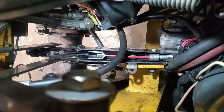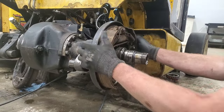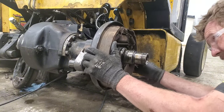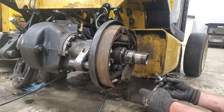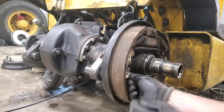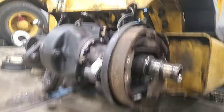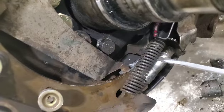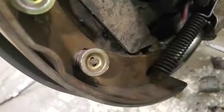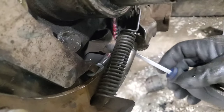Right here I lost all my audio — my mic gave out — but basically I installed new brake cables and ran those down to where the backing plates were going to be. They were damaged from earlier when the frame bent; something got up there and caught and pulled those brake cables out. So as I'm putting these new backing plates back on — those will get torqued down too — putting back on the new brake cables. With a little creativity you can kind of get the hook pried forward and get the cable put on. Saves a little time so you don't have to take the brakes apart, and you can still get the hook on there and get it in position — you just need to be careful.